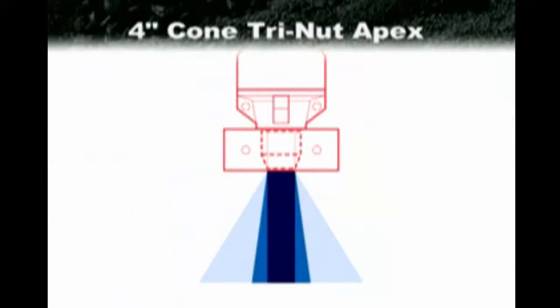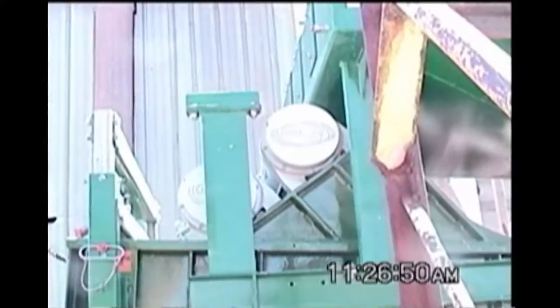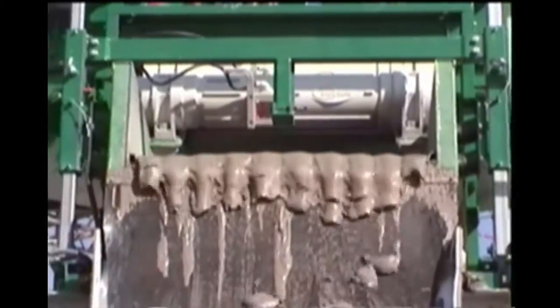This diagram illustrates the proper underflow pattern in medium blue to ensure maximum solids recovery and dewatering potential for the screening unit. Operation in this optimum pattern also minimizes wear and plugging potential. The dual motor screening unit fitted with Derrick's patented high open area urethane screen surfaces provides the final dewatering function. Typically, a 0.5mm or 0.7mm, or 25 to 35 mesh opening, is all that is required to form a filter cake of solids which collects the recovered fines. This abrasion-resistant screen surface typically lasts six to eight months in this application and never requires cleaning.